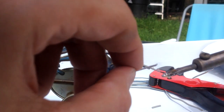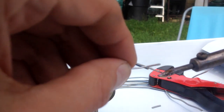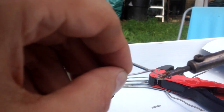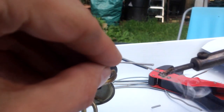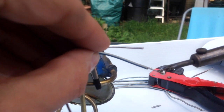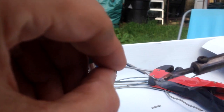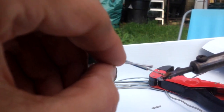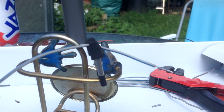The wire up nicely, that does. There we go, it's going on nicely now. Put a bit of solder on, pull it up a bit as much as you can. There we go. Nice, just get rid of that bulb on the end. And that should pre-tin your wire.